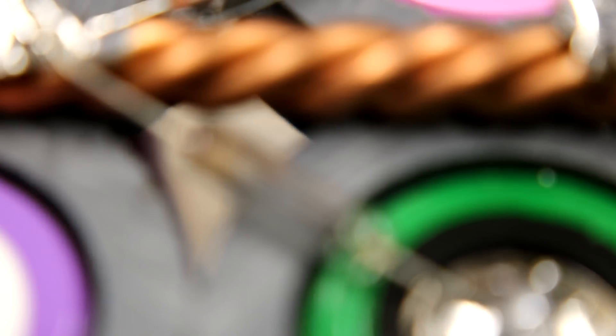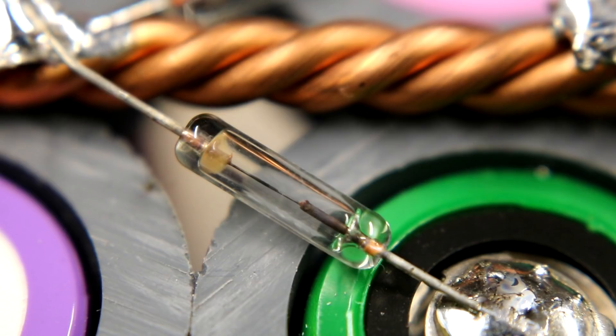There are no broken fuses whatsoever, but I did find one fuse that's a little darker in the middle. I might replace that fuse just in case, and I might pull that one single cell out and do a capacity check on it. Other than that, I guess there are some weaker cells in this pack. There's the fuse in question — it's a little darker in the center. This looks like one of those Fukushima green cells. If you look right in the center you can see how it's kind of burnt, so I'll probably pull this cell out and run it through the capacity checker.